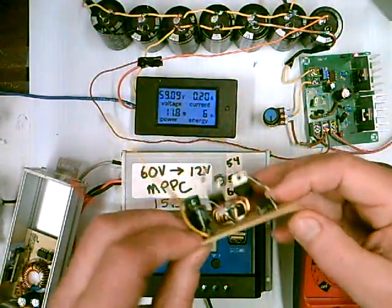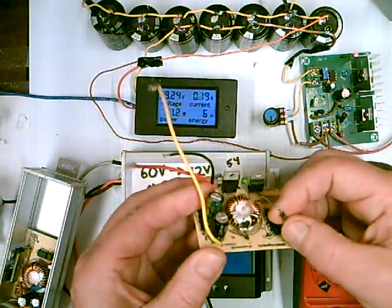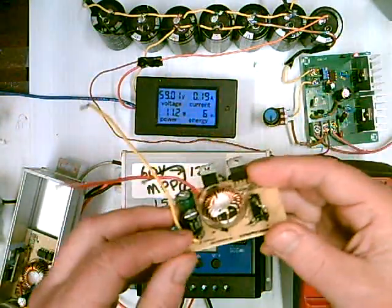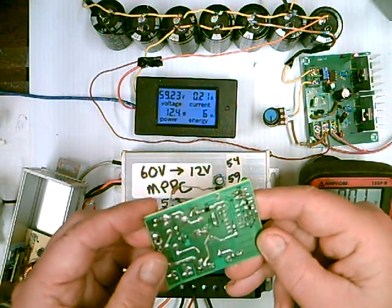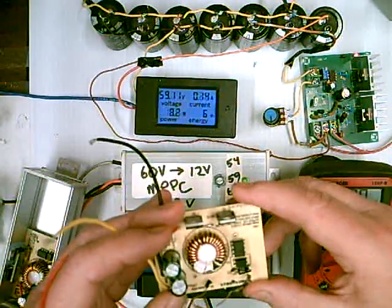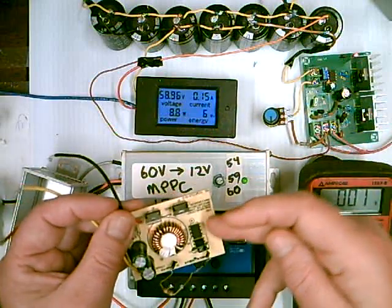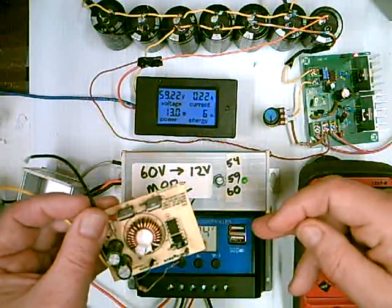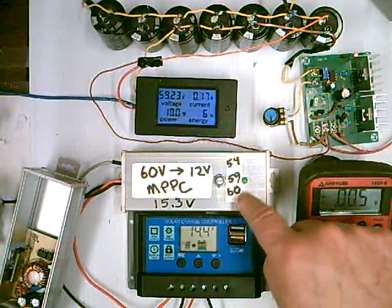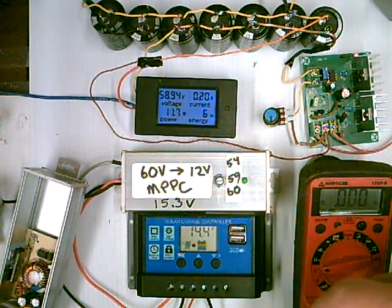One of the modifications is you go through and drill a little hole to break this trace. And you can put three, four, five diodes — this one has five diodes in it to get it up to that 15.3 volts. That's fairly easy to do. And there's some other electronics to keep it at power point. We keep it at power point by faking the regulator that the output voltage is too high, so it shuts things down. I've set it up so I have a range from 60 to 54 volts with this, and that seems to work pretty good.